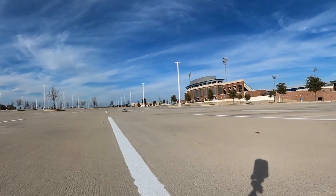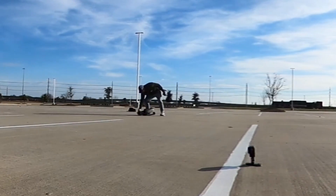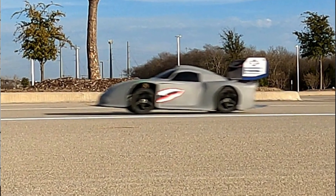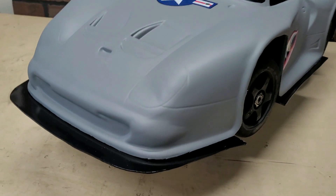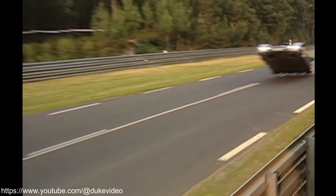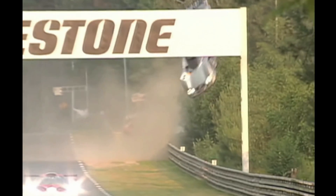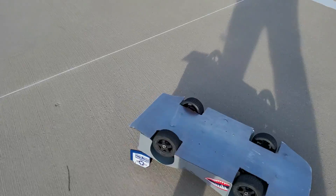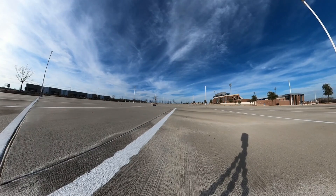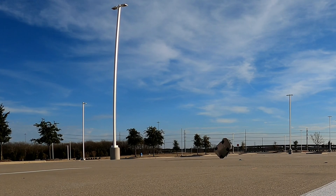In this test I'm seeing something I really didn't want to see: the aero is really unbalanced. It's actually so unbalanced that the rear end squats enough to put this massive front splitter and under tray at a positive angle of attack. I had put this big front splitter on here to try and balance the front and rear aero, but it looks like I didn't succeed. I've essentially created the Mercedes CLR — a self-flipping car. After a few flips, everything was still working fine; I was pretty surprised at how sturdy it was.